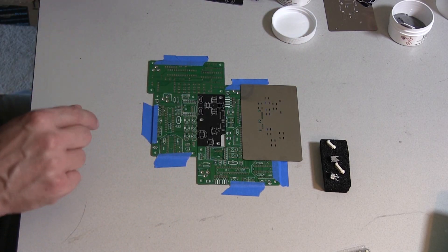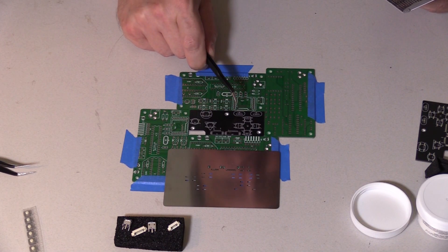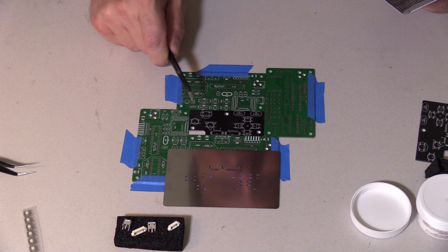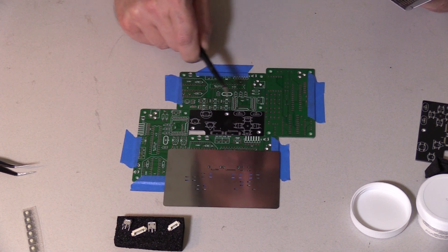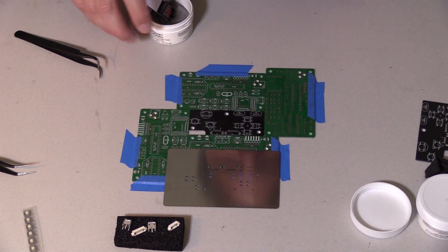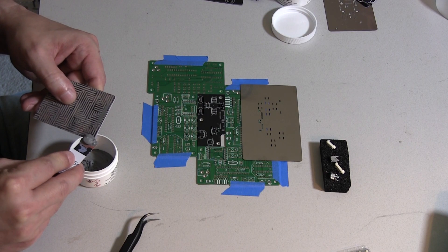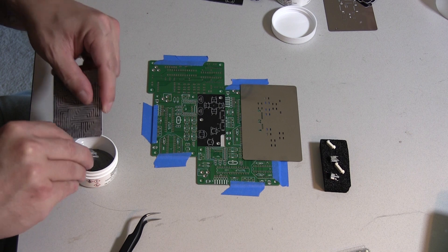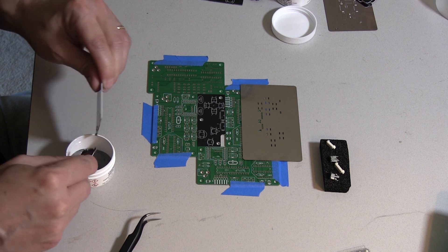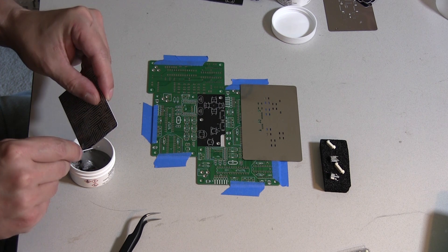What we want to see is that it's not slopping outside the solder pads, especially on the micro USB — that's the most critical part. You're not going to get any solder jumpers on these big pads if it goes outside a little bit. The solder won't stick to the mask; it'll find its way usually to the pad. But if it's a very fine pitch, that could be a problem. So put the excess back in — I don't want to waste this stuff, it's not cheap.